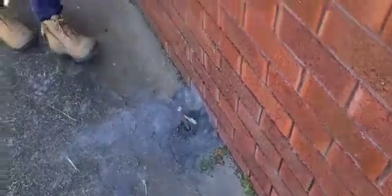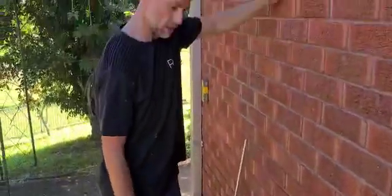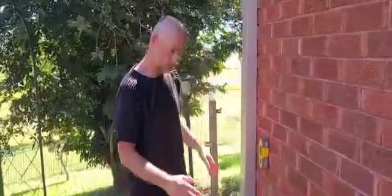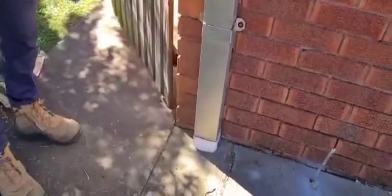You can see it was a different coloured dirt. That was about 1.3 metres that was underpinned. The rest of the footing was about 600 millimetres deep. And then it was underpinned again on the corner, and then another one up the other end there.